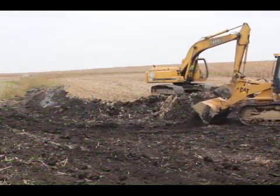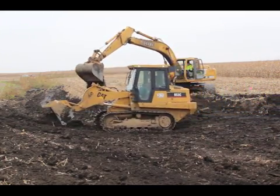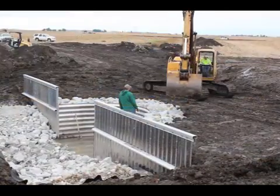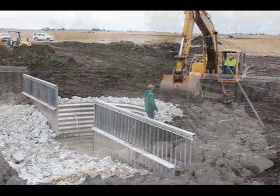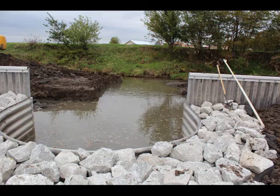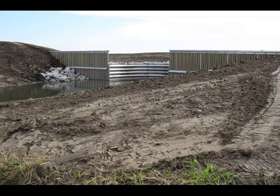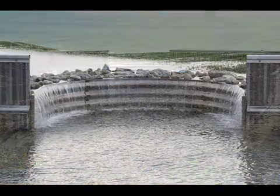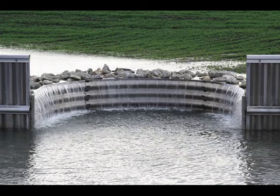To solve these problems, the landowner decided to construct a grassed waterway to convey the runoff through the field without losing any more soil, and place a grade stabilization structure at the end of the waterway to provide a stable outlet. Because of the large drop-off from the field to the stream, a six-foot overfall structure was needed. One of the main reasons the landowner selected a metal toe wall style structure is because of its efficiency — it will handle a large amount of runoff without taking up too much space in the crop field.